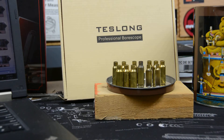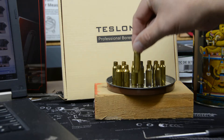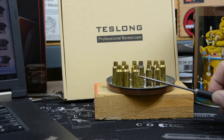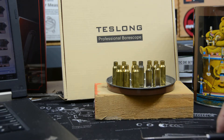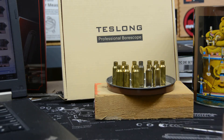Welcome back to Hasbro's Hide. I mentioned in previous videos that I thought I was getting case head separation, and you can see it well in these cases. These are 10 that I pulled out, and there's a line right at the base that I was really getting concerned about. About 10% of them after about five firings — some less than that — were showing this line, and some of them were quite heavy. So I pulled them out and put them into our brass scrap can.